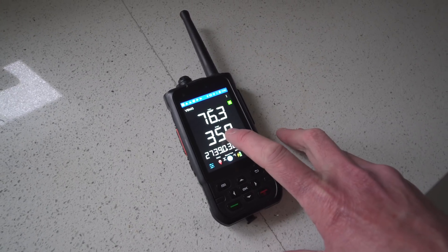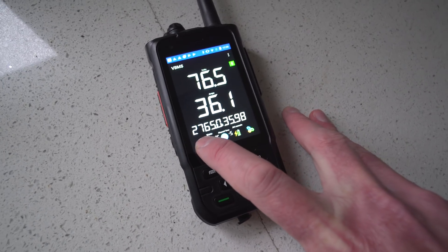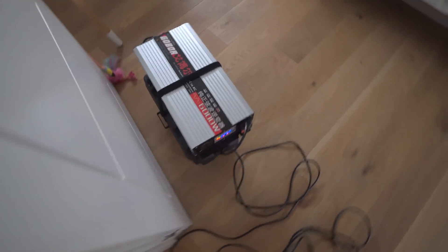Kettle's going — 35 amps going out of the power pack. This is the great thing about having a really high voltage power pack: the higher voltage means less current. We're taking about 2.7 kilowatts out of that inverter and it's only drawing 36 amps from the battery. You can hear all the fans kicking in but the air coming out is cold. This will run a car — you've seen me charge the Twizy off it, so no big deal. I was thinking I might stick some wheels on the bottom so I could wheel it around wherever I need it. It is pretty noisy though — the fans come on on pretty much any load on that inverter, but rather that than it overheat.